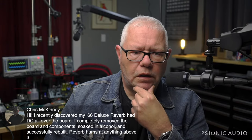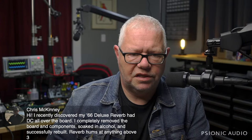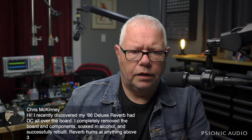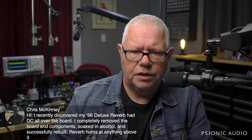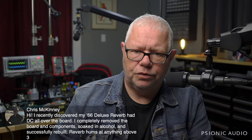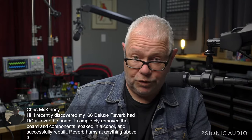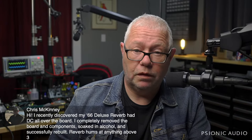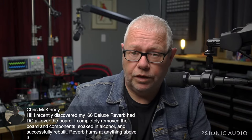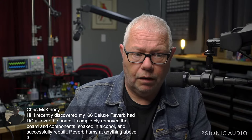Hey, Chris McKinney, your reverb hums at anything above 3? It should not. It should not hum at all. And it's a 66. Something's up with your reverb circuit. See my videos on this, where you can actually use the reverb send RCA jack as a speaker out. You get a little RCA to quarter inch adapter and run it out into an 8-ohm cab, and you can listen to just what's coming out of the transformer send, which would be going to the tank. See if you have hum there. If you have hum there, you probably have a bad reverb driver transformer, but you should not have hum. You can also mute the input of the reverb using the foot switch, the return of the reverb, and then turn the reverb up. And if you have hum there, then it's in the return stage. But the hum should not be there.